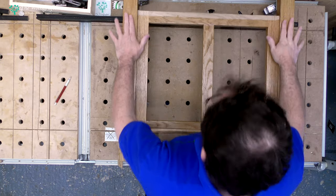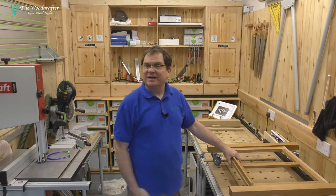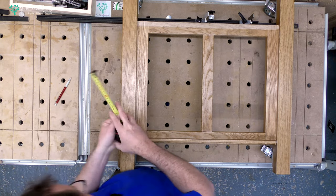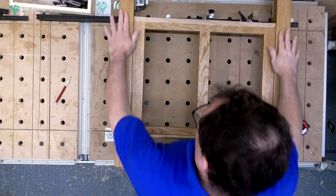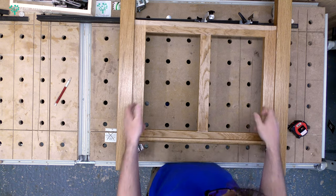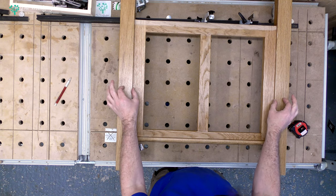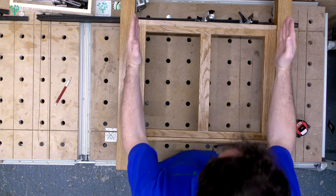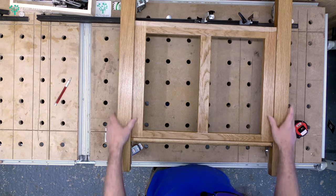This is our mobile base. It's made of oak, finished with a couple of coats of Osmo — no other reason than I had it lying around the workshop. It's got these two large joists here going across, and these are 60 by 45 stock. It's got an internal frame that the planar jointer sits on. This internal frame is dado'd quite a long way into these main joists, so the main weight of the machine sits on here and is transferred into those joists, making it super strong.